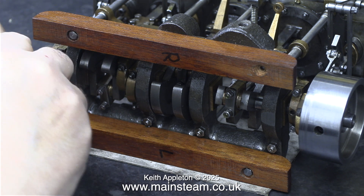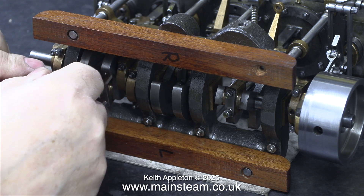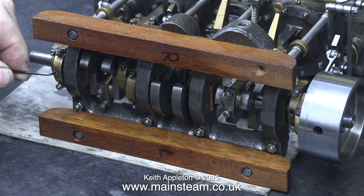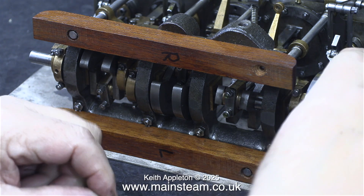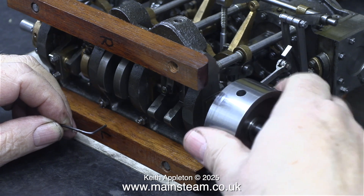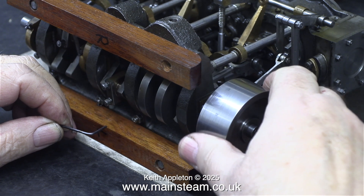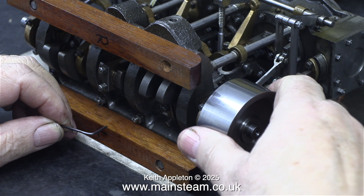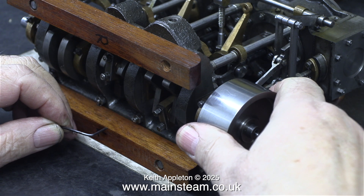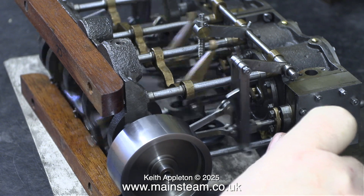That just about covers the cladding. Now I'm going to show a little bit of tweaking of the engine to improve its running characteristics. This clip shows just how easy it is to adjust the position of the eccentric sheaves. I'm leaving the intermediate cylinder's eccentric sheaves well alone — they're held in with very small slot-headed screws, and the timing of the intermediate cylinder seems okay when I look through the hole in the side of the block. I've adjusted the eccentric for the high pressure cylinder and am now working on the low pressure cylinder. Suddenly the engine bursts into life, running noticeably better — it's running in quite nicely now.